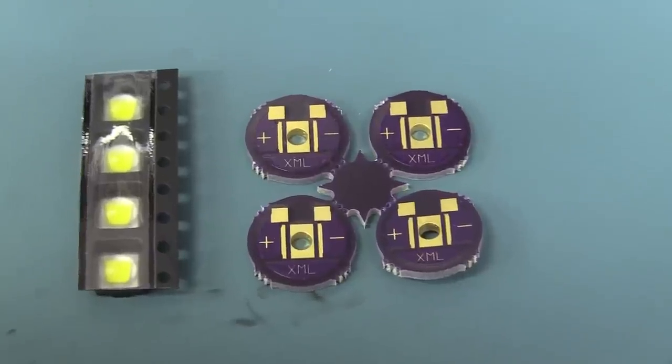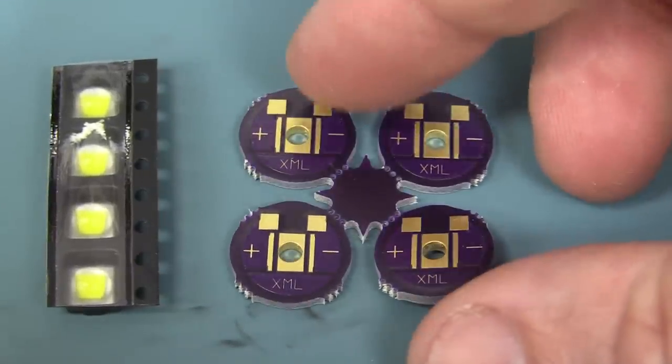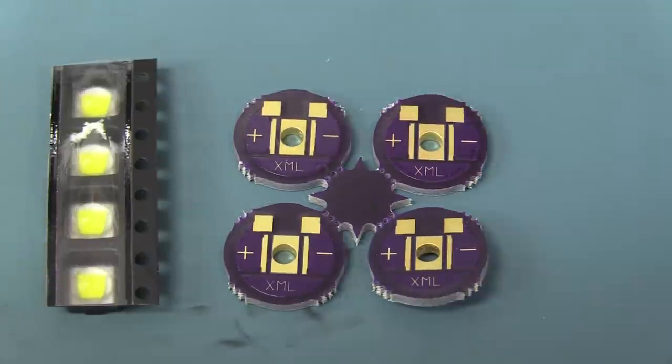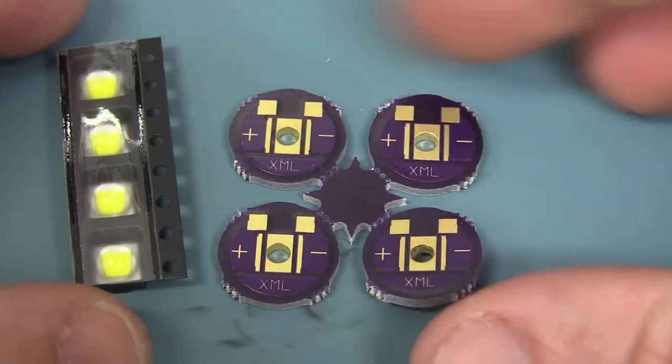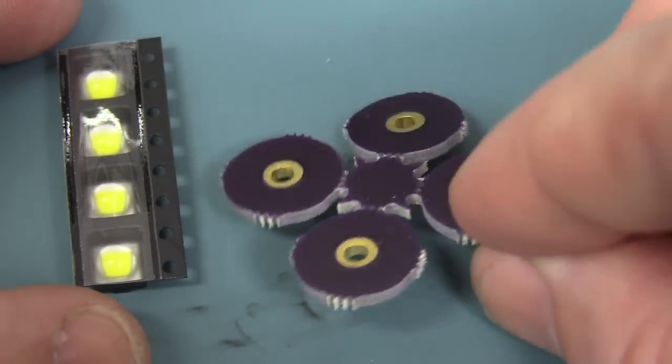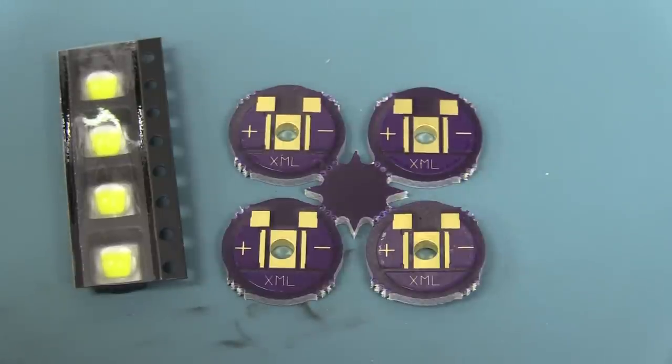They've supplied some examples of how this thing actually works — how you put your hole through for your stud, so your Power Peg just goes inside the back. You solder your Cree LED onto there, and that's how you can get the heat out of that sucker. Terrific! Huge thumbs up to this product. He started his own company three years ago just to make these thermal Power Pegs. These are terrific, they really are.